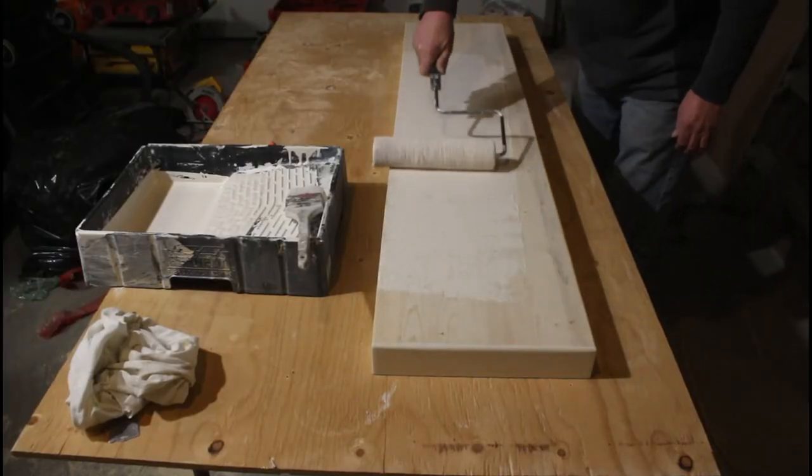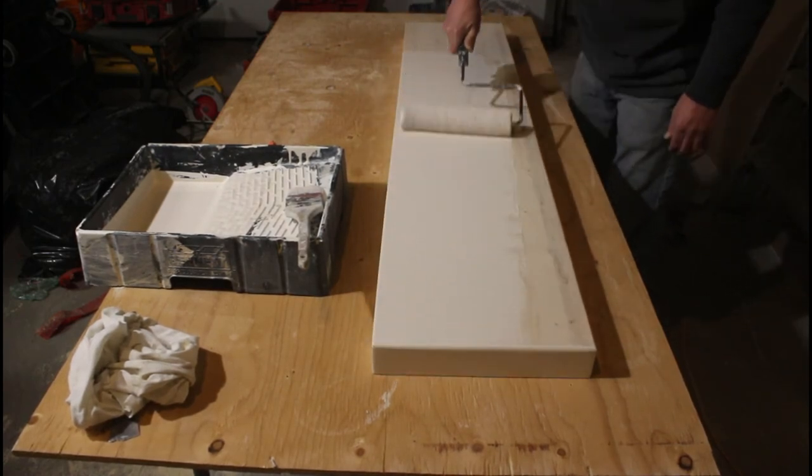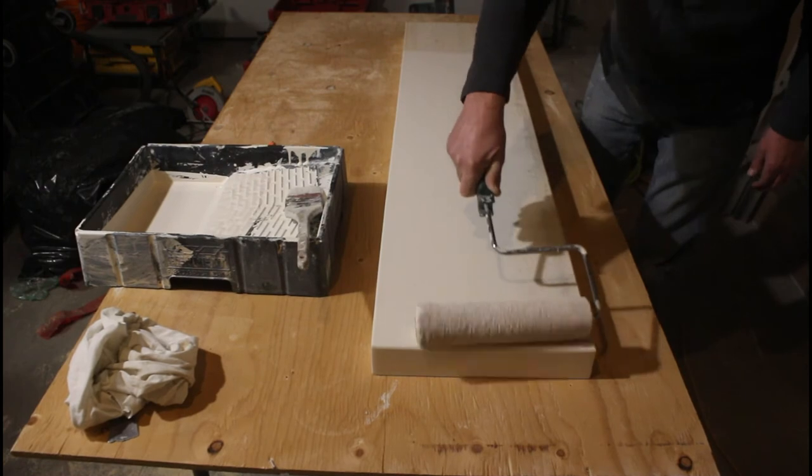I've decided to paint the wood white, so I'm going to use a primer to seal the raw wood first, applying primer to both the bottom base and the top shelf. I was a little worried about the grain popping after painting, but even with the primer the grain really stands out nicely. Once the finish goes on — a satin finish pure white — I think that grain will turn out really, really nice. Once this primer completely dries I'll add two coats of pure white finish.